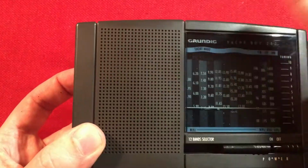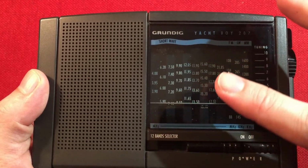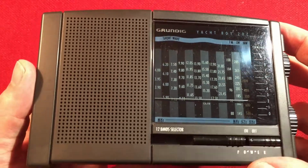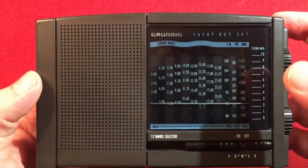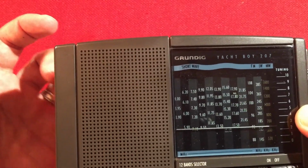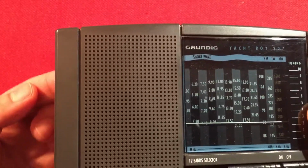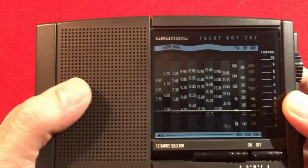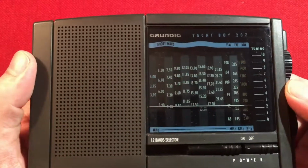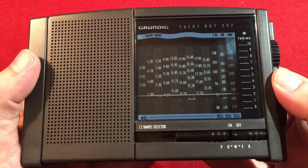Apologize for dust. When I got the radio, it had moisture inside the radio, or like damage on the dial, so I cleaned that off, and some dust got trapped under there still. I think the fault may have happened with the FM. The radio used a clip on the inside, and somehow somebody pulled the antenna out and the clip must have fell loose, shorted something out, and permanently destroyed some connection somewhere. So I wasn't able to find that at all. But again, I was able to bring back the shortwave, which was amazing after a lot of trial and error.